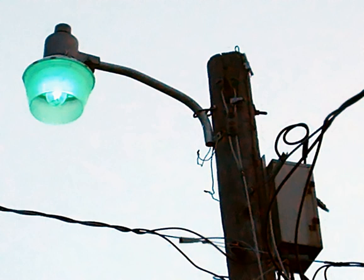For example, a standard 250-watt general lighting mercury lamp produces significant output from 120 GHz to 6 THz. In addition, shorter wavelengths in the mid-infrared are emitted from the hot quartz arc tube envelope. As with the ultraviolet output, the glass outer bulb is largely opaque at these frequencies and thus for this purpose needs to be removed or omitted in purpose-made lamps.